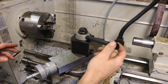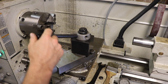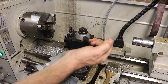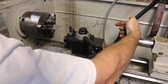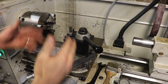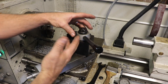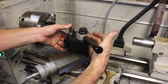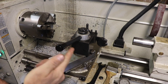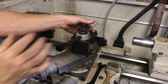Other real improvements I've done to this lathe: the way they had this handle attached — it was actually screwed in there. When your tool is on and you cranked this down, the handle was facing out here, so it was just awkward to tighten. It was pointing towards your work, and the way this thing's built, there's no adjustment. I took it apart — you can't adjust where that goes — so I just drilled and tapped a new hole here so the handle ends up where I wanted it, tightening here instead of pointing toward the work.